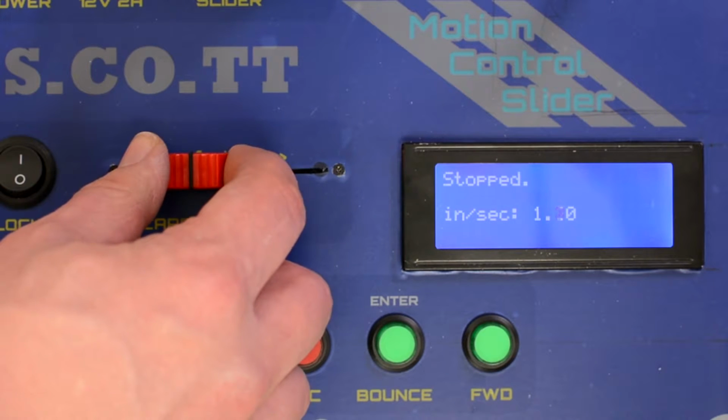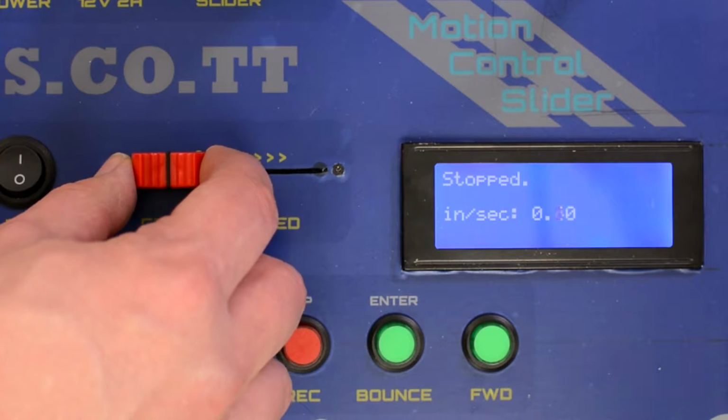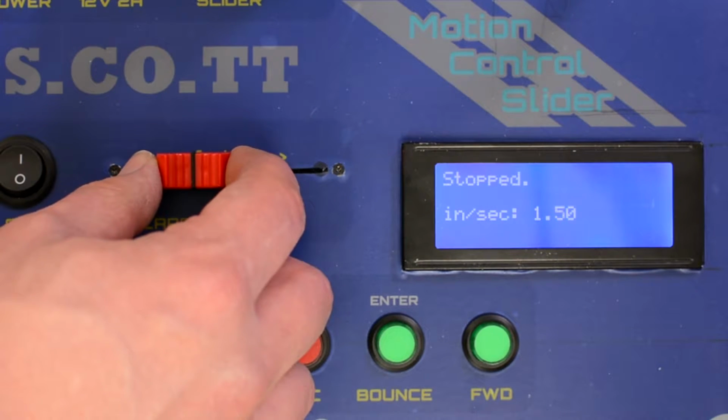One difference is that if you adjust the speed when the slider is stopped, it will update the display with that speed in inches per second. That allows you to match new moves with previous moves. Unfortunately, calls to the LCD library are a bit heavy, and they create a noticeable jitter in the movement of the stepper motor. If I could do it all again, I'd have used either a Raspberry Pi or 2 Arduinos, one to drive the interface and one to drive the motor.